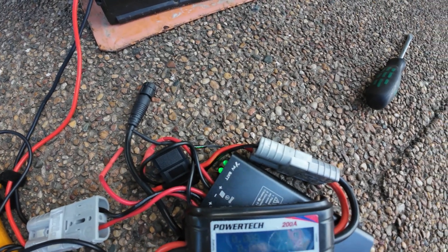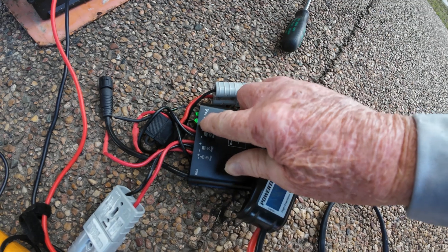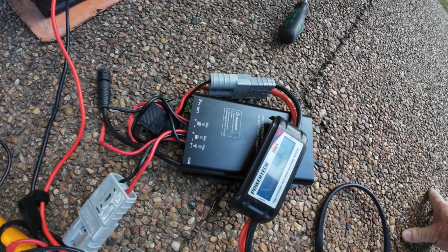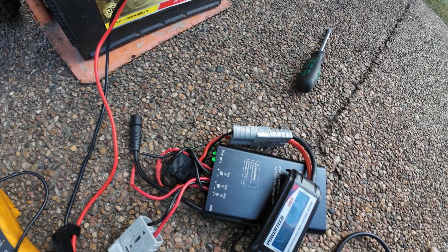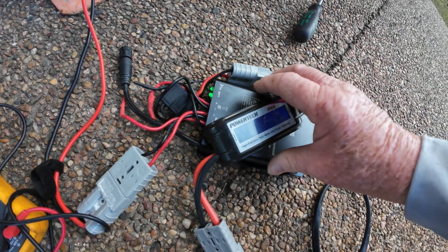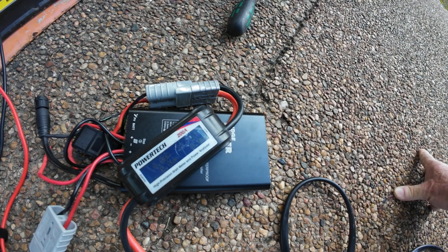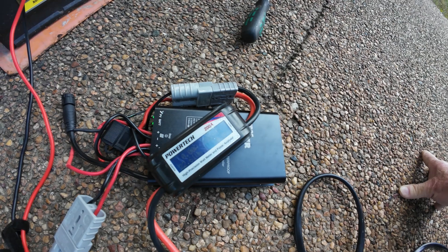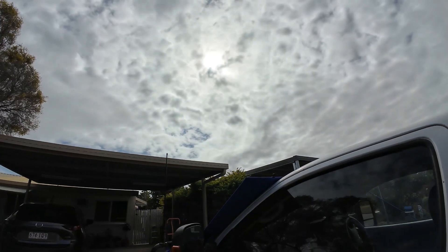The battery's light is flashing and the battery charger indicator says it's charging. Solar panels are connected and my meter says it's putting 14 volts into the battery. The solar blanket is pumping out 22 to 24 volts. It doesn't look like it's going to bring that flat battery up but I'll see how it goes. Yeah, it's a pretty cloudy day today — occasionally there's sunshine but it's not very often.